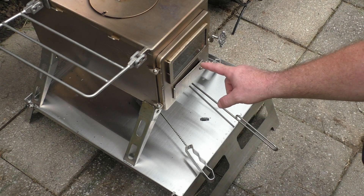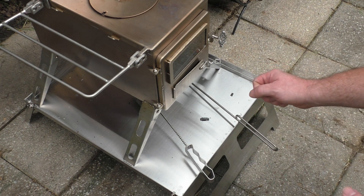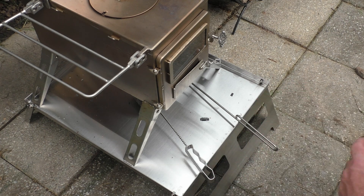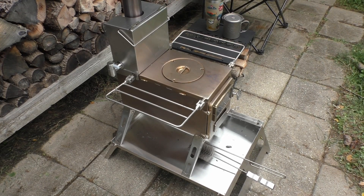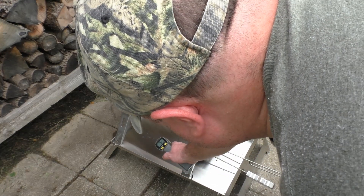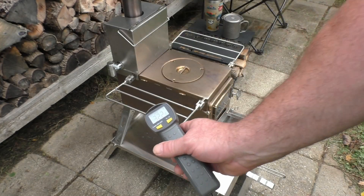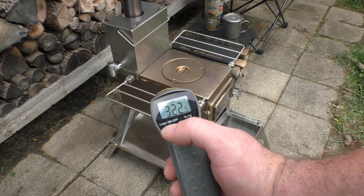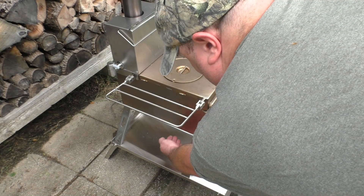Once I get a really deep bed of coals like I had during my accident, I'm going to open it on camera so the coals pour out and you can see for yourself. I've been running the stove a little over an hour now, so I thought I'd do some temperature measurements with my infrared thermometer. The surface underneath the stove is reading 322 degrees Fahrenheit or 161 degrees Celsius right under here.